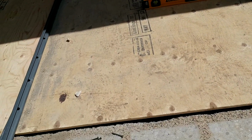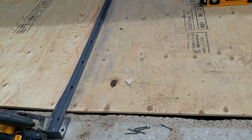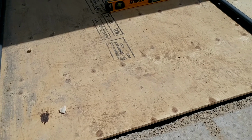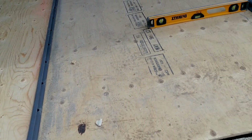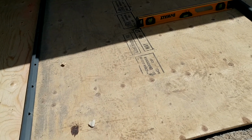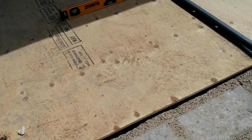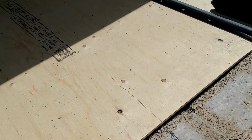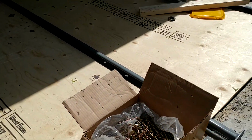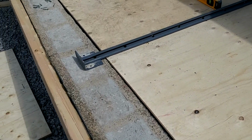If you had to build a plywood form, it would take the same amount of time, right? No, I would say this is quicker, unless we use the steel decking. This was quicker than framing 2x4s and all that underneath. Taking this apart after is going to take half an hour rather than half a day if we build out all the framing work underneath and take all the lumber out through the house. It's more money because when you do that, you have to use 3/4 ply. This is only 1/2 inch plywood on top. This might be more money in terms of the actual system, but definitely cheaper in labor. And no rebar.